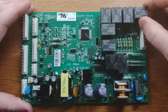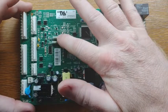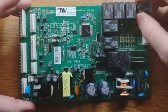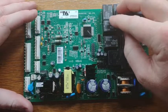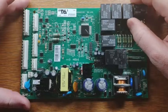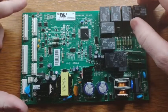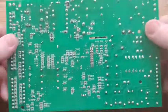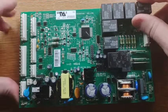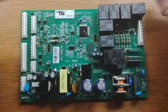And there you go, guys — that's how it's done. You just replaced all the relays on your control board, the resistors for your fan motors, and the troublesome capacitors that you see fail most often on these control boards. If you own a GE fridge long enough, you're going to have to do a control board — they're just that awful. But you could keep one of these rebuild kits on hand, tape it to the back of your fridge just in case you ever need it, or just do a preemptive rebuild as preventative maintenance. Either way, that'll get a little more life out of the board you have and hopefully save you some money, not having to buy a $300 control board. Thanks for watching, look forward to hearing from you.